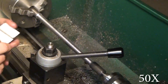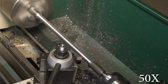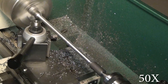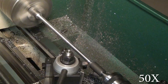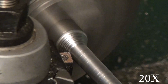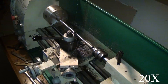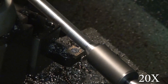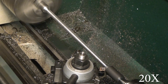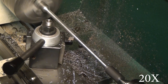You'll probably notice there's a very slight taper to the minor diameter of this work. That's because my tailstock's out of alignment, and I was able to fix that a little bit later, but it didn't affect the performance of this project at all. I got a super terrible finish on this material like I always do with 1018, but I keep buying this stuff because it's so cheap and then I just hate myself the entire time I use it. I don't recommend using 1018, cold or hot rolled, and stay away from A36 or whatever that other crap is. It just sucks.